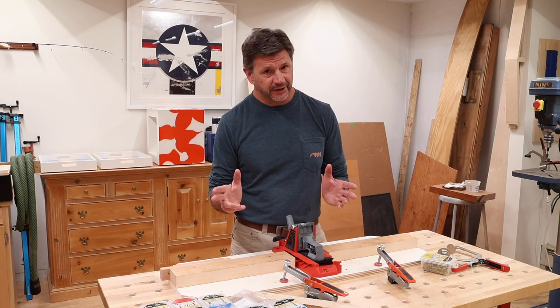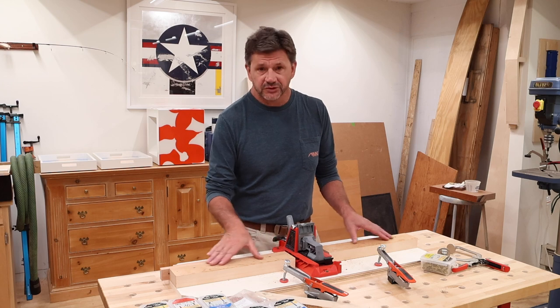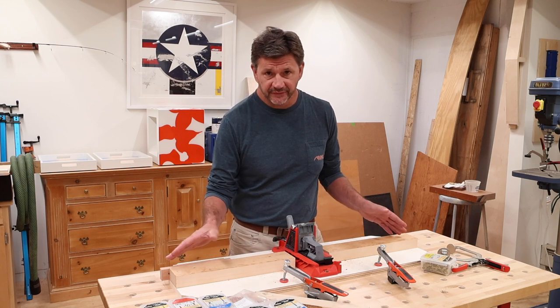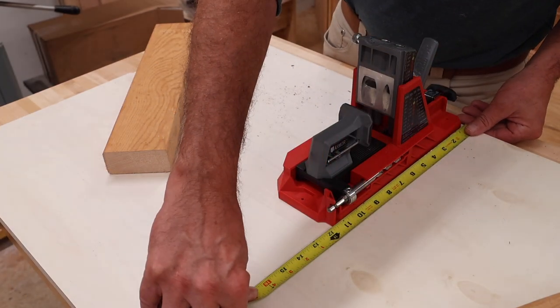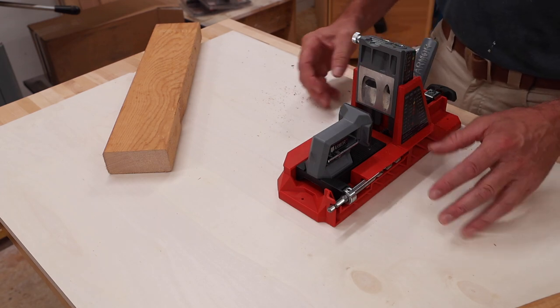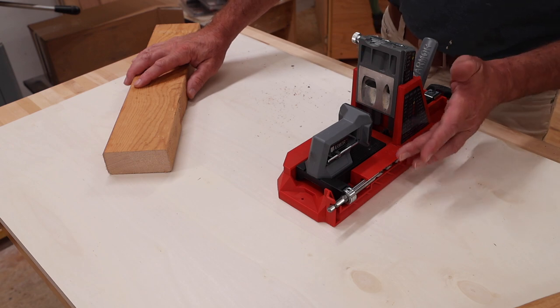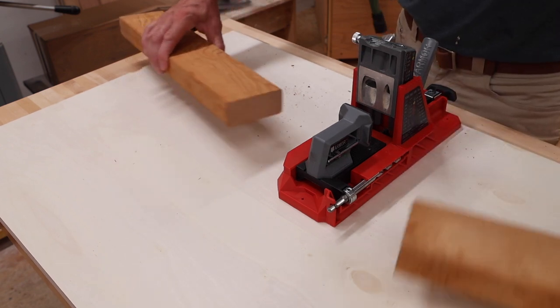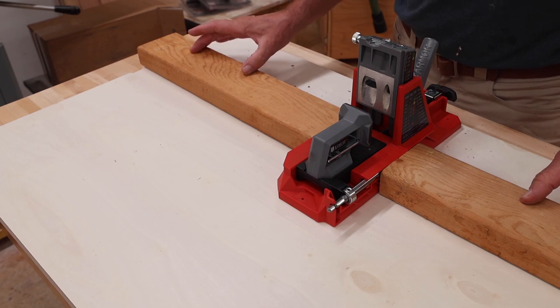I think the best way to use this jig is to mount it like I have here, with support wings on both sides of the jig. The jig measures just about 12 inches deep or 12 inches long, so I'll rip this piece of plywood at 12 and a half — gives me a little bit more room. The jig is also an inch and a half high, so I can use a standard 2x4 for support wings on either side.